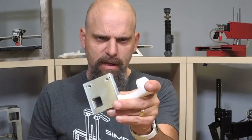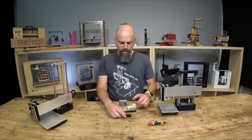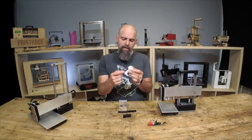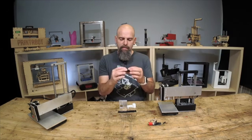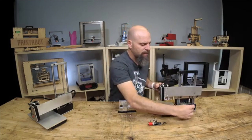Aluminum X motor and Z motor mount, which also holds the Z rods. The Y arm bar ends in Delrin for a perfect fit on the bars, more strength on the belt tensioner and the belt tie-off. So those will be Delrin. And then because there's a Z-rod on this base unit bar end incorporated into that part, you only need 3 Delrin blocks. I call them bar end blocks for here, here, and there.